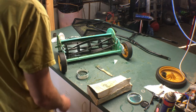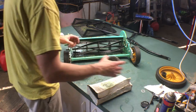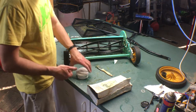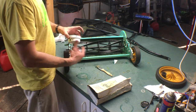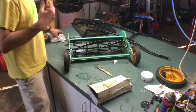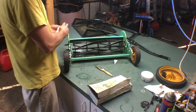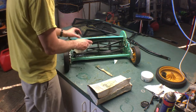Well, that was a process. Why I do it in stages is I take my grit and I apply it to the reel, and then you run it and it's really rough going at first, and then it smooths out and becomes easy. And once it becomes easy, then you stop, re-grit it, do it again. So that I did it about 5 times. So it was about 5 minutes, but this blade isn't crazy out of whack either, right? Like, it was mostly cutting.